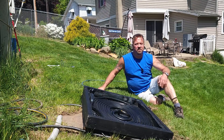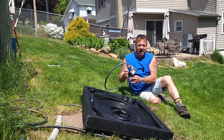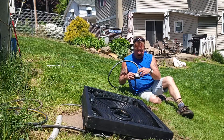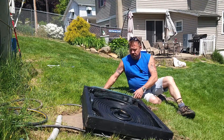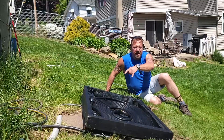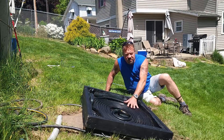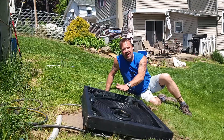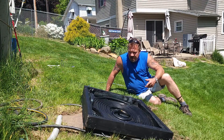For now, I just put it back together to start heating up the pool. Inside the pool, I have this little garden fountain that I got from the local home improvement store. It's rated to pump 300 gallons per hour, and it's just connected to a piece of garden hose, which connects to our 50-foot black hose running through here. As the water comes in, the sun is heating up this hose with the plexiglass over it. It traps the heat inside, and the water circulating through has time to pick up the heat and get back to the pool.